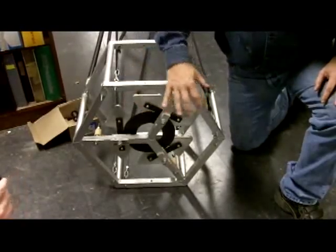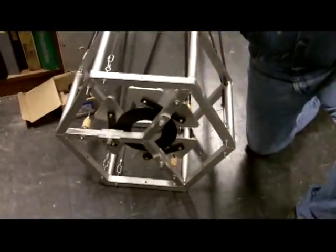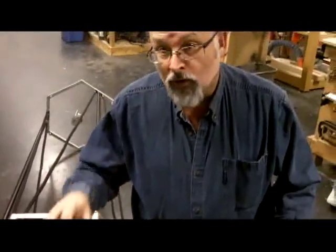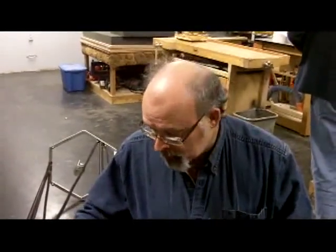Once all of these pieces were clamped to it, I marked the intersections where it's going to have to be welded and cut, and used a 4-inch hole saw to open up those knuckle joints, so that all of these pieces were clamped onto that wood when it was welded, and so they all remained immobilized during the entire welding process until all of the welds were done and it was cooled off. That way, it didn't twist or warp on me. If you don't do that, aluminum will twist in every possible way that it can.